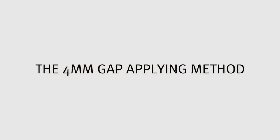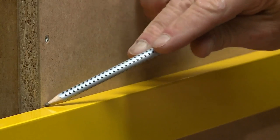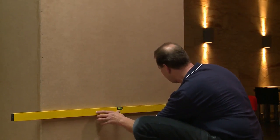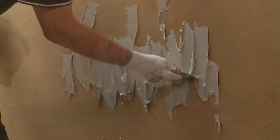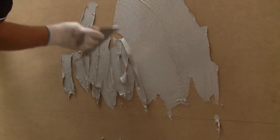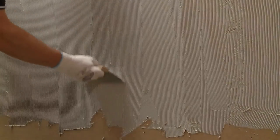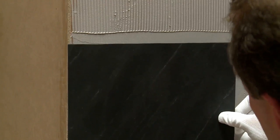The 4 mm gap is another method of assembly for the skilled expert. Applying this method, glue the stone veneer sheet with a gap of 4 mm. First measure the wall surface and afterwards apply the glue in the marked area with a good sense of proportion. While gluing, take care to align the first row in an absolute straight line.